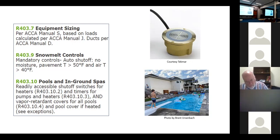Is that like a radiant heating? Basically that. Yep. It's a thermostat. This is the way we did it. You put welded wire mesh down for the whole driveway, and then you run the tubing, and you have to do a calculation. But you run tubing generally on 1 foot centers back and forth, and you'll have a lot of tubing in a big driveway.